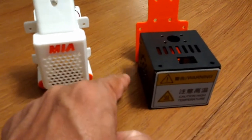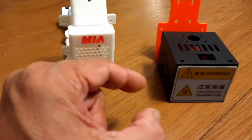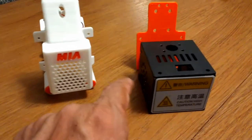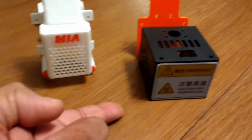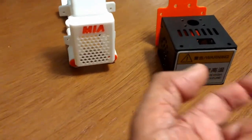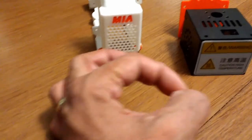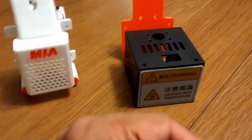The other thing was the part cooling fan, which sits on the left-hand side as viewed from the front. That fan has a little slot on an additional part that you attach the fan to and hook to the side of the cover, with a little duct that acts like a scoop feeding only one side of the machine. I thought if we had a symmetrical part cooling system, that would be better — cooling the part on both sides. I even designed a round one to cool the part fully, encapsulating the cooling area 360 degrees around. That was working as an add-on to the stock setup, but I decided to start from scratch, and this is how I came up with the system you're seeing here.